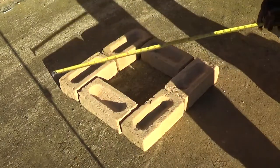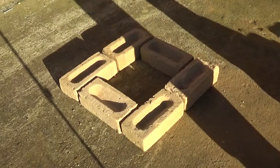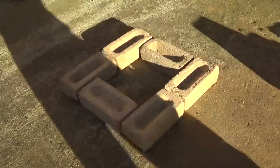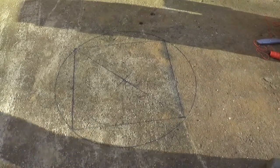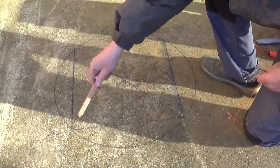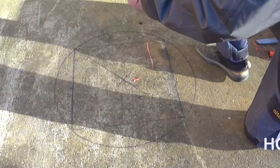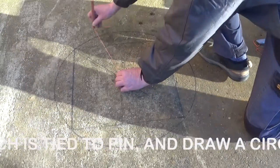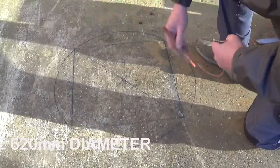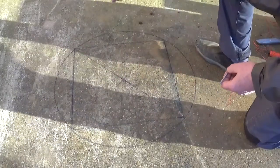Four plumb points on every portion. Firstly, take your diagonal measurement corner to corner — that works out at 620, so 620 is the diagonal. Now I've done that, I'll show you how I set out the pier. You can see where I've set out the pier — 440 around here, done my diagonals, I've got my centre point. I used a screw and a pencil, pulled the pencil tight to the corner, put the screw with the string round it, and drew round — that gives you a circle. Each twist will marry up with the outside edge, the perimeter.